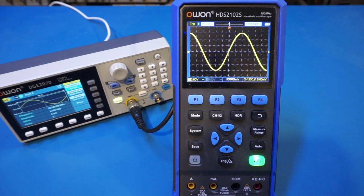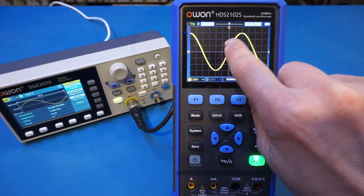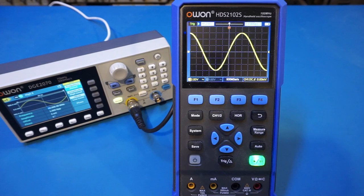But let me change the horizontal to 2 ns per division. And now let's see — we're taking up 1, 2, 3, 4, 5, 6, 7, 8 divisions. So the cycle is taking up 8 divisions, which translates into 16 ns. Clearly, the display is incorrect.